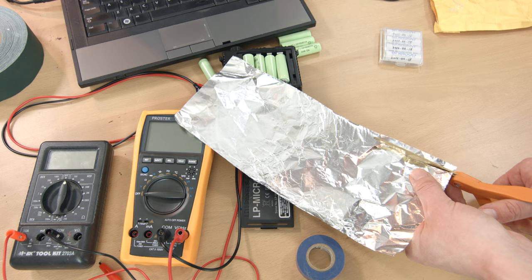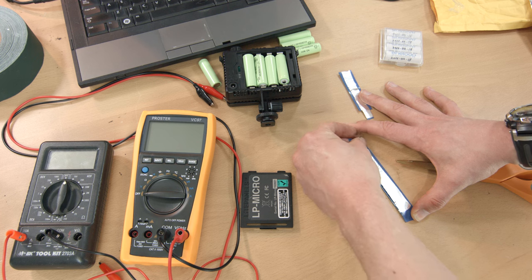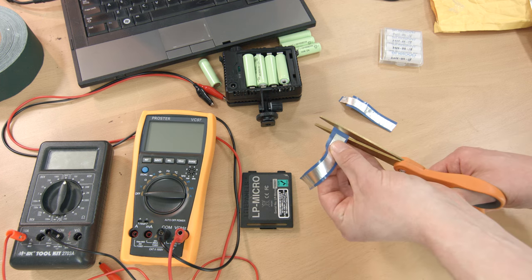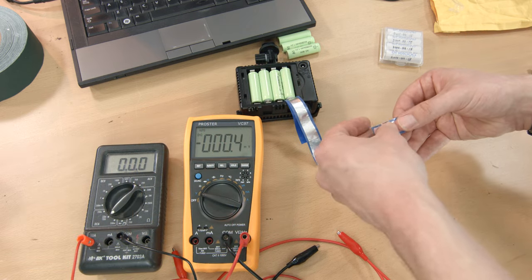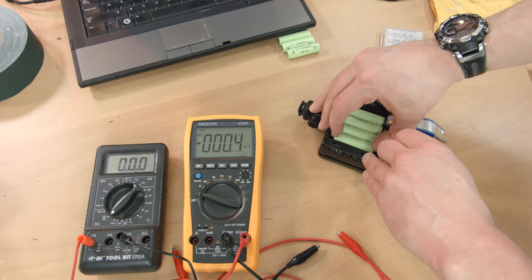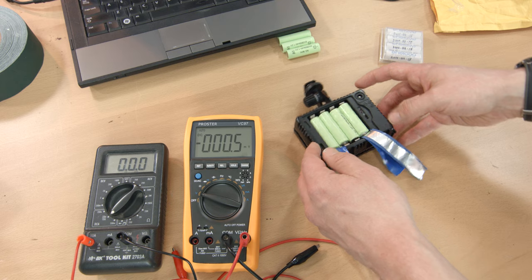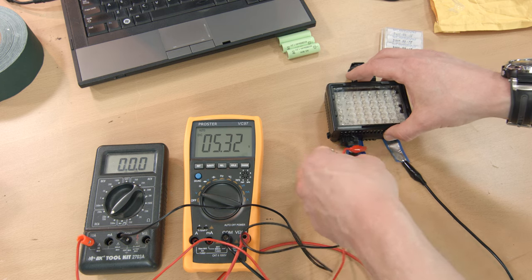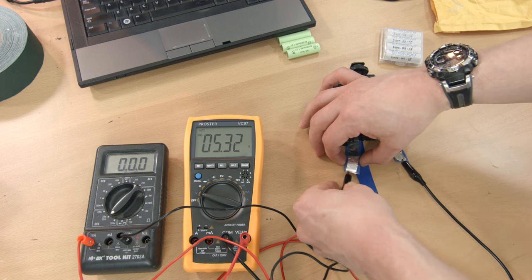I took some aluminum foil from the kitchen and cut a strip about a centimeter in width. I stuck the foil to a short length of electrical tape, keeping it centered. I made two of these in different lengths — cutting one end right across the foil, leaving the tape a bit long on the other end. The sides got a trim to bring them closer to the size of the battery contacts. I made another strip with the foil sticking out past the tape significantly. The first two strips are oriented back to back so the tape insulates the foil strips from each other. Stuck into the light panel next to one battery terminal, I could jump from my ammeter across the two strips to tap into the circuit. The other strip of exposed foil would tap the other battery terminal so a multimeter could be connected across the entire battery, allowing the light to lie flat on its back visible to the camera alongside the meters.